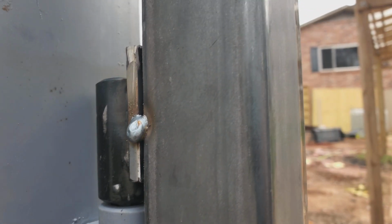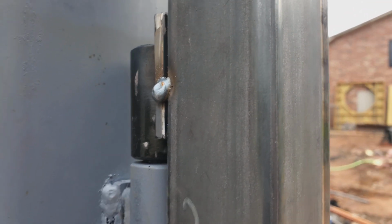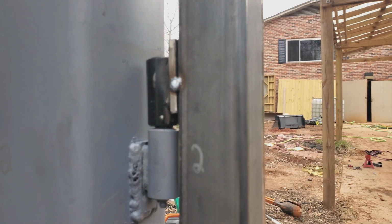All right, guys. It struggles with that thicker material on 110. It's not meant for it. So it's all boogered up, but it's holding it. You can see that big old booger. This needs to hold it though. It just could not, so it's holding them in place though, so I'll bring it back up to the shop carefully and finish welding them off the 230.